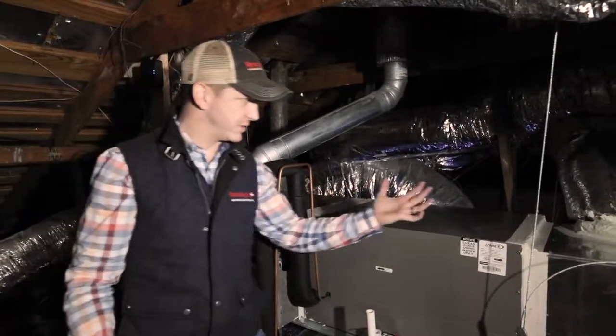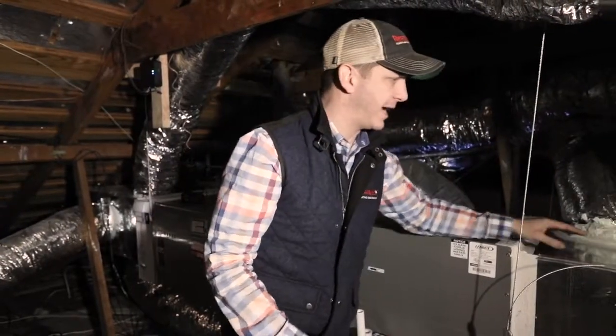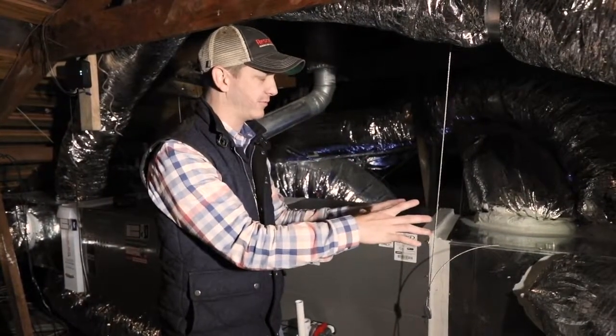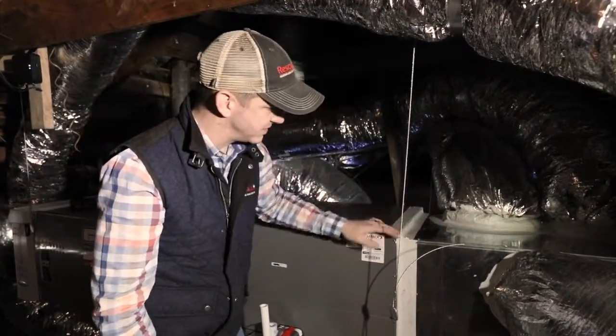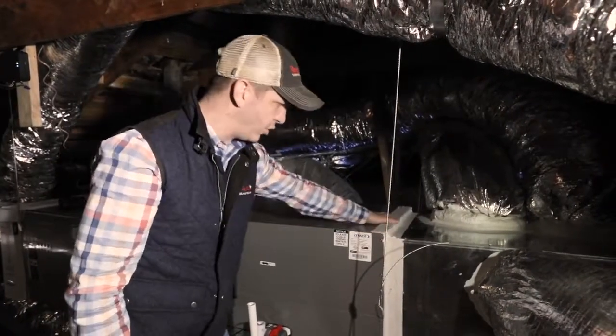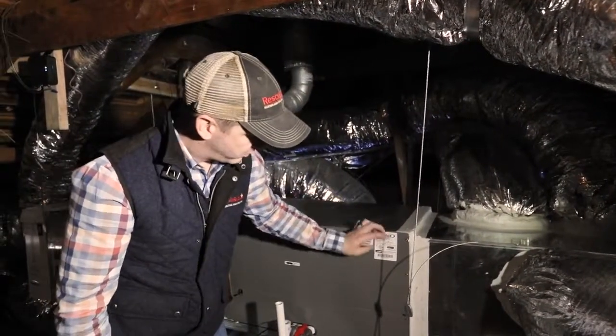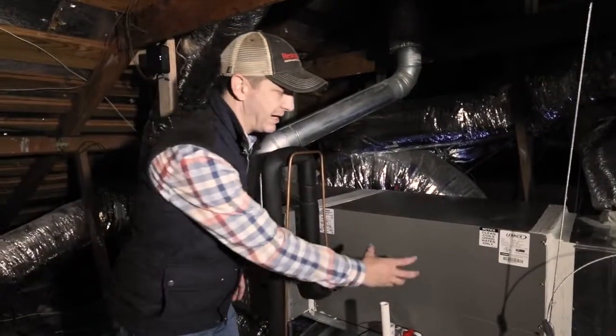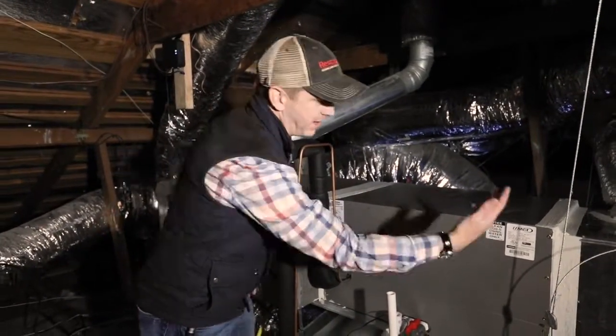This is one of the things I was talking about with our lifetime installation warranty. If we put our hands on it, we guarantee this will stay together forever. You'll notice clean lines. Our tape is masticed over after it's been taped on. We leave the cabinet accessible, so we can do maintenance on it. Your coil's inside of here.